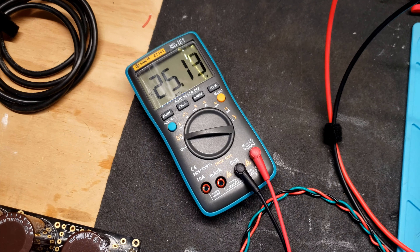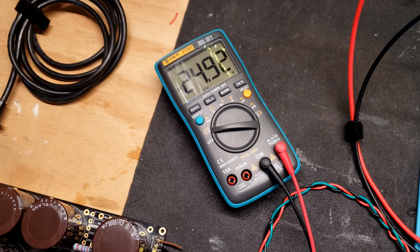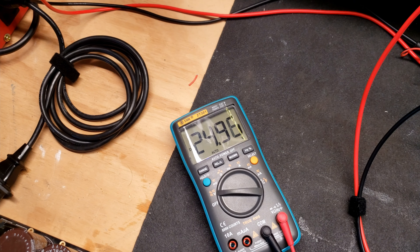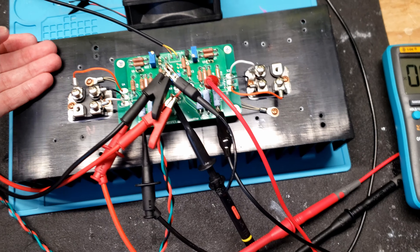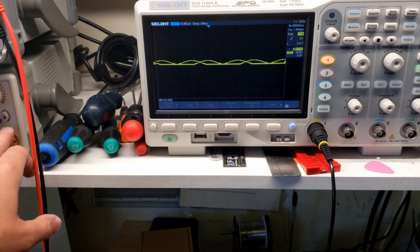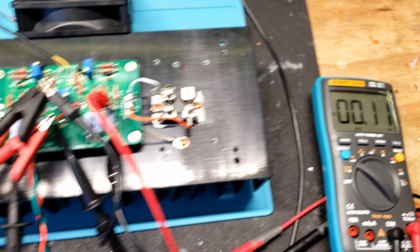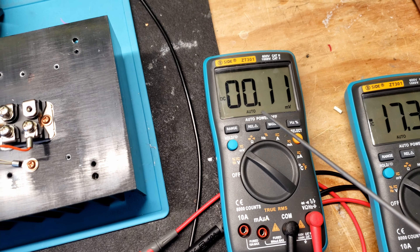Let's bring it up to 25 volts — back this off just a hair to get it really exact, it breathes on the variac really slowly. We're at 24.92 volts — I'm happy with that. We have hardly any millivolts here, there won't be any heat or noise. I'll turn on the signal generator. We've got something but hardly anything because we have no gain and no bias yet. Per the instructions, we need to turn the pot up so we get about 600 millivolts. We'll do P1 first.